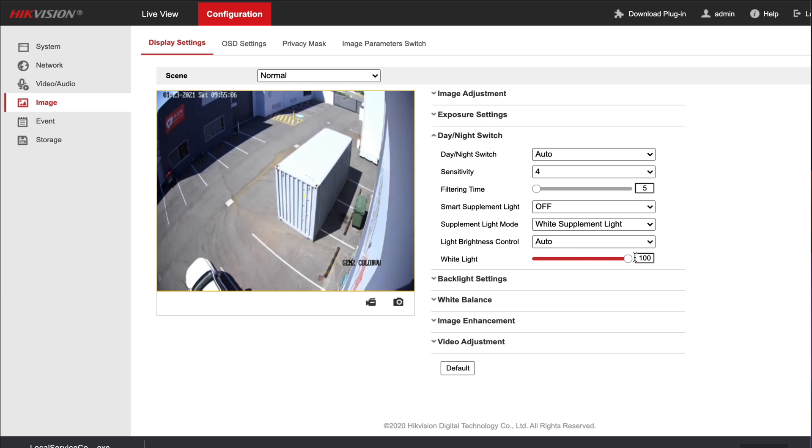What's the alternative? Sometimes people are happy to have that white light on, and we can still use that white light alarm feature. We can have the white light set to be on but at a lower amount — you've got from zero, which is obviously off, all the way up to 100. In this situation I've got it set to 10, but we still like that active deterrence feature. So when someone walks into the shot, you see that white light intensifies to the full 100%. That's a nice win-win situation. For the front of your house where you don't want to annoy neighbours, you have it set to zero — no light — but only coming on if someone comes onto the driveway. And in dark areas where it's not a problem to have the light on, always have it switch from low to high, because that active deterrence is an excellent feature.